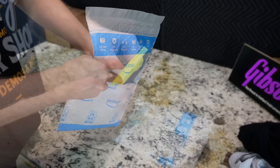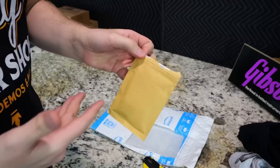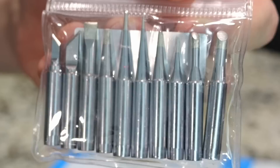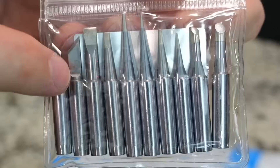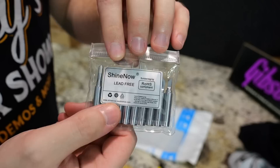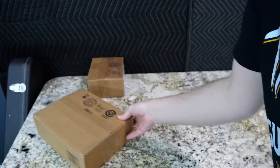Next up, from the episode where I chopped that Chibson double neck in half — unfortunately I burnt up my solder iron. While I miraculously got that thing to work — I was very proud of myself, it only took me two tries — my solder tip has gone dead, so I picked up a set of these. I never realized there were so many different tips. I'd always use something standard, but I've been having great results with these chiseled tips. So if you've been struggling soldering, maybe try a different tip. If you don't keep the tip clean, it doesn't heat up properly and you just have all kinds of bad times.